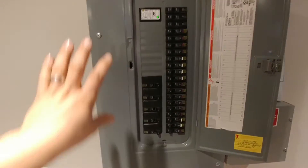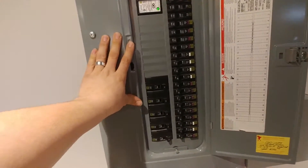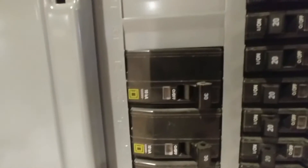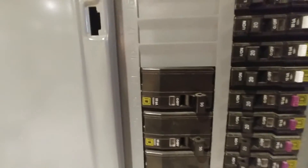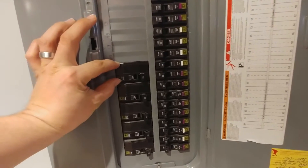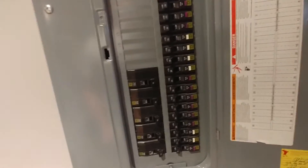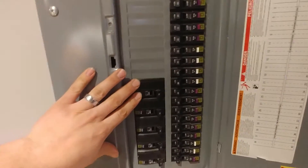We'll start by figuring out what you're going to need for your electrical. If you're adding this, you need two spaces available in your electrical panel. Here I have a QO electrical panel, Square D, and you need a double space available for a 30-amp double-pole breaker. Water heaters are typically 240 volts, which is why it's two poles — 120 volts on each pole. I will link in the description to the materials you're going to need. You have to make sure that the breaker you buy is specific to the type of panel that you have.